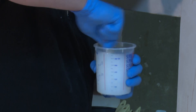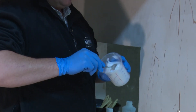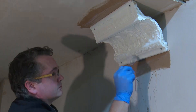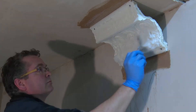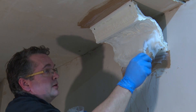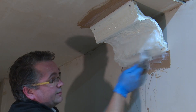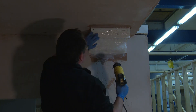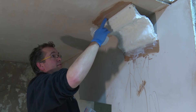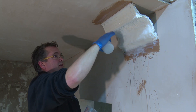At first the thixotropic will go in with not much difference, and then suddenly the mixture will become quite stiff. Using a palette knife or similar, press this material into all of the low recesses, doing your best not to trap any air. The material is now finishing its pot life — you can tell because it's becoming stiffer to apply. At this point stop trying to apply any further. Make a second batch to complete the top section, thickening up to the ceiling and down the lower section, making sure this is one smooth curve all the way to the top.